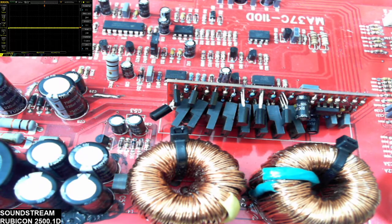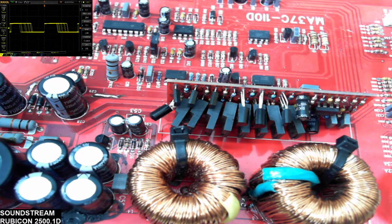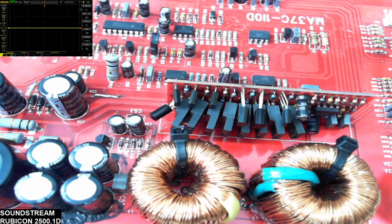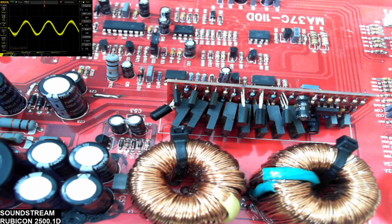You'll see that you get your drive on your output transistors. There's your output drive on the output transistor on your high side. I can't run this for very long — I don't want my output transistors to go into thermal runaway because the high side does get a little warm. I stay real cautious when testing these amplifiers outside the heat sink. I have a 50 Hz signal at roughly 3 volts going into the preamp, and there you can see the output drive signal right at 50 Hz.